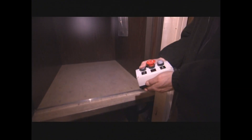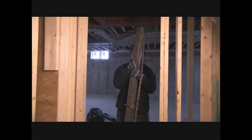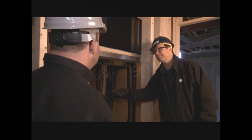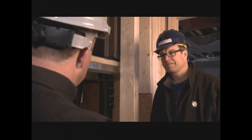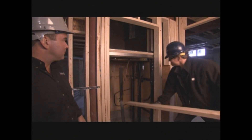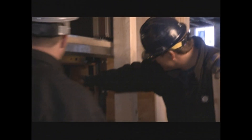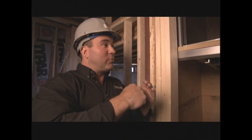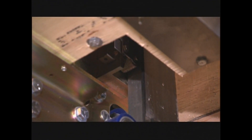First we're going to raise the cab up. Grab that pole there and lower the elevator slowly onto the pole. Right now the entire weight of the elevator is resting on that post. What you're going to do is knock that steel post away, so you have a full ton of weight being stopped instantly within a centimeter of space. Three, two, one. Wow, this thing barely moved — the cables are still slack. What stopped it? There's a mechanical brake on each side on the T-rails. There's a knurled roller that sits very close to the rail, and as soon as that knurled roller doesn't see any tension, it fires against the T-rail and stops one ton in less than that much space.